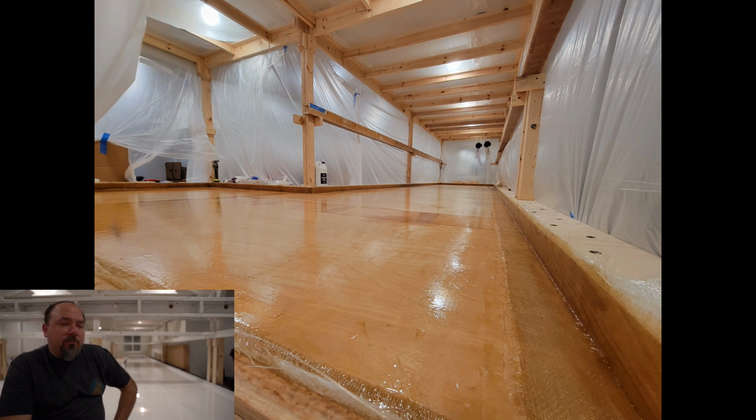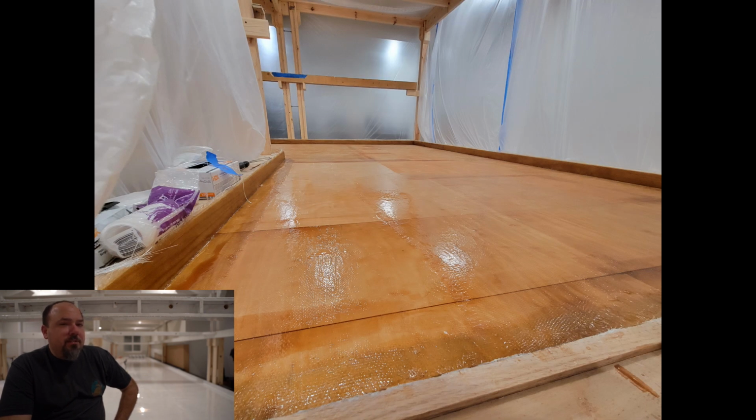And while I never really did that, I did have a couple instances in the garage and here where maybe I put too much hardener in, or for whatever reason didn't mix it right, and it went ahead and prematurely activated on me. And probably the most notable one is I had about a pint of resin that turned on me, and this stuff literally goes from workable to hard jello within a few seconds. It is amazing how fast it will turn on you, and there's not a ton of indication other than your little internal clock going, you're running out of time.